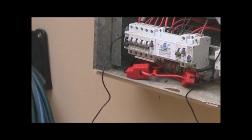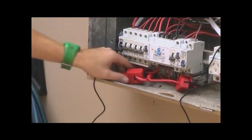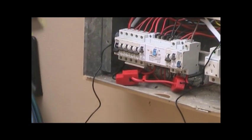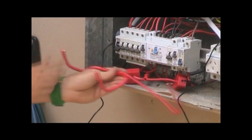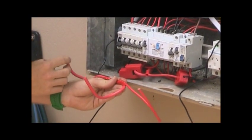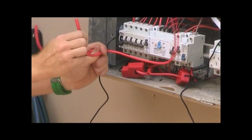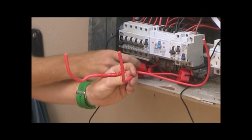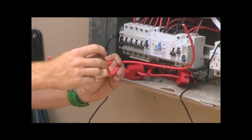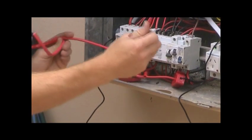Obviously, anything to do with electrical, you do have to keep safety in mind and always work dead. So what we've done here is onto the main switch — this clamp goes into the main switch. Then we've got this light and power circuits clamp — that clamp goes onto your light and power circuit into the center, and then you've got your clamp off to the side for the solar.